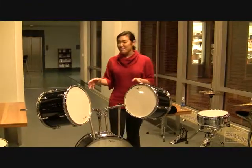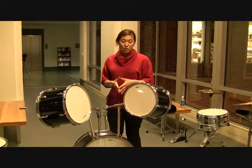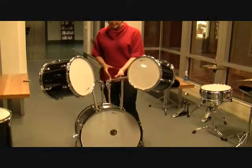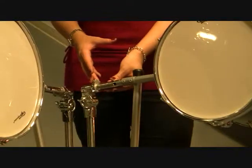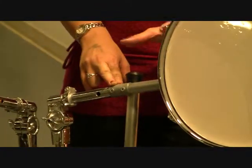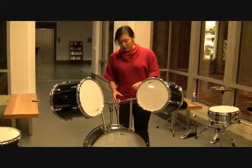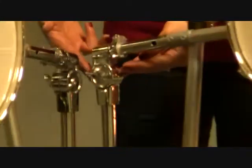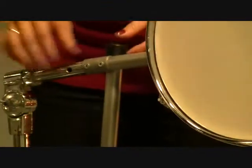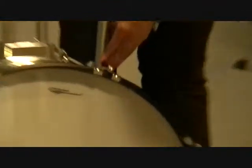The drums that sit atop of the bass drum are called toms, and one of the major modifications that we have made to our kit is to extend the toms closer to the drum player. This is done by extending the existing tom tube outwards by a tube connector, and this extension can be made from 4 to 15 inches. However, because of this increased moment arm, the stress on this particular joint is increased, and to minimize this stress, we have added this support tube that drops down from the tube connector down to the support screws and latches onto those support screws of the bass drum.